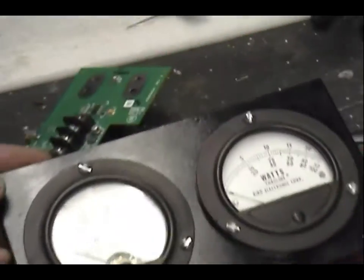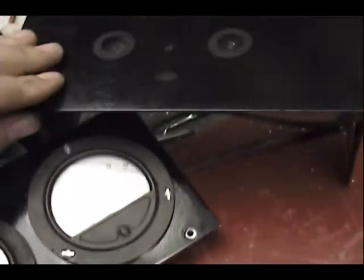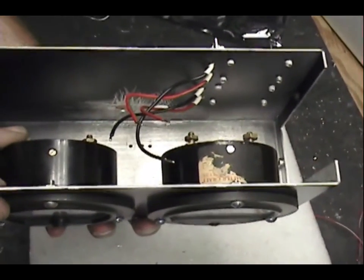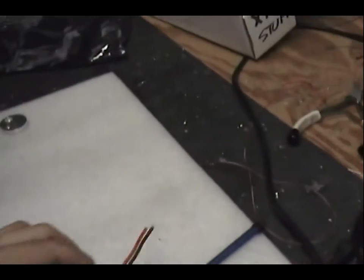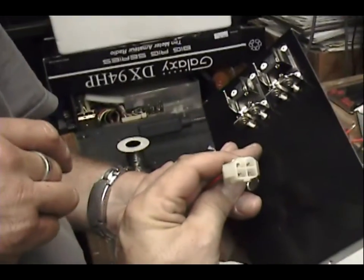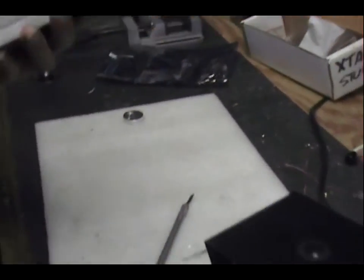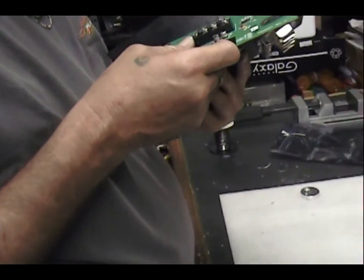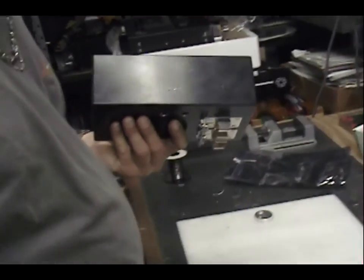He's got a little meter box like this — real small, not a lot of space in it. We're going to have to put that circuit board inside there and make it so he's got two meters on here. He's going to have a quick disconnect plug right here so he can plug in and no longer have to take the meter apart. The button for the peak and average is going to have to stick out the bottom. He hangs it in the overhead of the tractor.